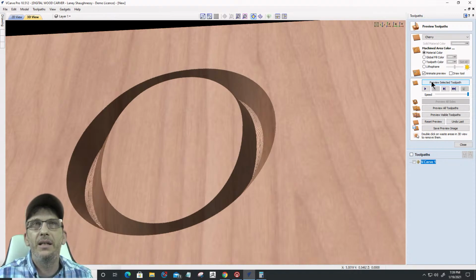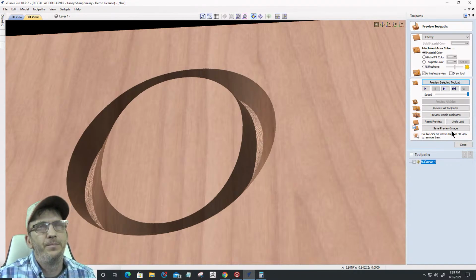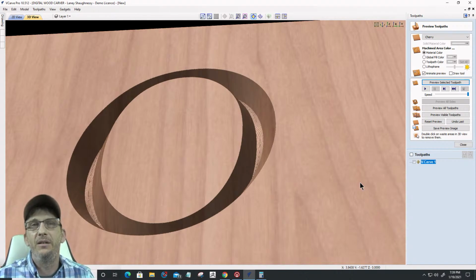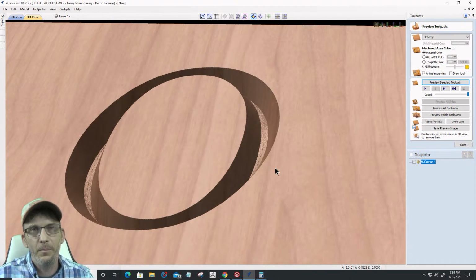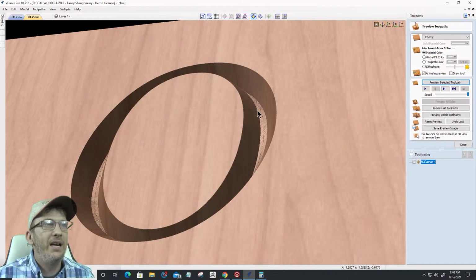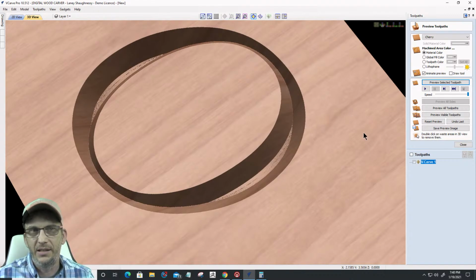With a 90-degree V-bit, I believe, or even a 60-degree with a half-inch head, the cutter height is 0.435, I believe. And on that one, I don't take the full pass. 0.2 is kind of my cutoff. So to answer your question, depending on the bit I'm using, I am taking a full pass with a 1/4 inch 60-degree V-bit, but I'm taking pass steps, depending on my letters and objects, if I'm using a wider V-bit, because 0.2 is my pass depth setting. But generally on the wider areas, it's taking multiple passes anyway. It's not doing it in one plunge. In shallower areas, it may be taking it in one cut, or a couple of cuts.